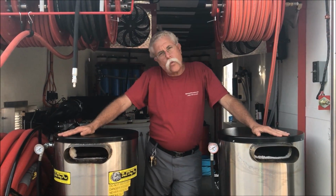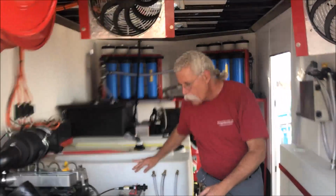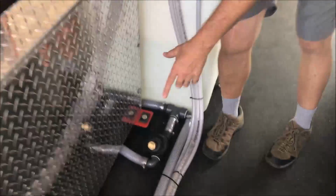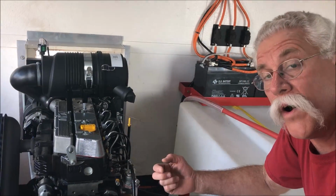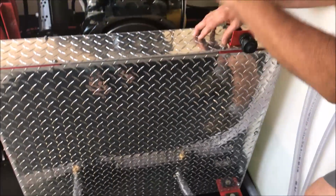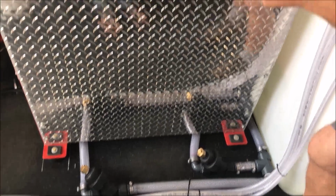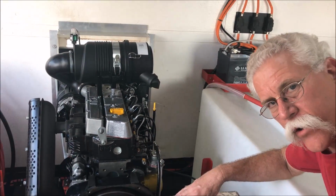Anyway, the water feed to this system, if we can go back in here to the pump again, we have dual filters running to each of 2 1.25-inch lines that run into splitters underneath the pump. So we're feeding 1-inch lines to each side of the head. So let me get that straight. You're running a 1.25-inch line to each 7-gallon-a-minute pump, and still dual feeding that pump is its best chance to live a long time. The pumps are very low to the floor.